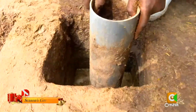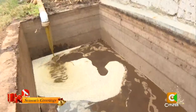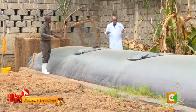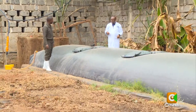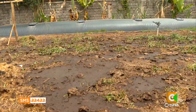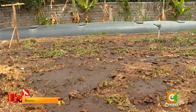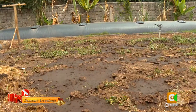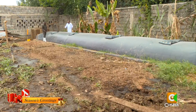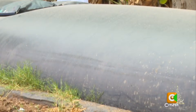Once mixed, the cover is opened and the slurry flows down into the system. The inlet pipe goes about four feet down into the ground, and the overall system is around forty feet in length. The design requires the waste to go down because of the weight — the pressure of the waste material on top is an important part of how the system functions.